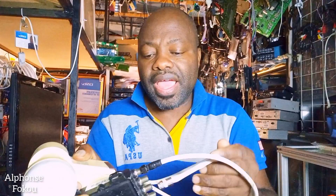You need to connect two cables to your LNB. On your Explorer box in South Africa we use IS-20, so we're going to connect on the HL and VL. We're going to use this tool to connect the signal coming from our dual LNB. From the two cables it goes directly to the dual LNB input. Make sure you connect on IS-20 because in South Africa the name of our satellite is IS-20.